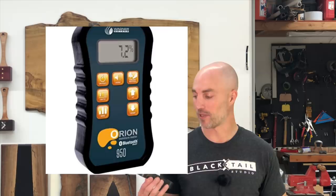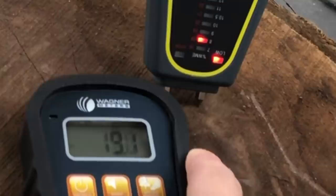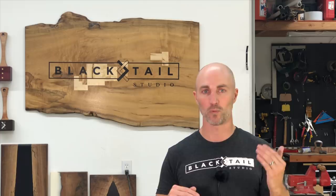The simple answer is you get a moisture meter, and not all moisture meters are created equal. The people at Wagner were kind enough to send me their top-of-the-line pinless meter. The difference between a pinless meter and a pin meter is this one actually senses down into the wood, whereas a pin one only takes the moisture right on the surface — and those are incredibly unreliable because the outer surface will often be dry while the inside is not. This one senses three-quarters of an inch down into the slab, ensuring you know if the inside is truly dry. A reputable slab supplier will most likely have a similar Wagner pinless meter.